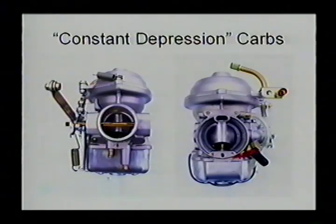We also use dual constant depression carburetors, which maintain a constant mixture as you climb — it's automatic mixture control. It works pretty well on these engines, so you only have typically one throttle lever, no mixture control, and you just start it and stop it with the ignition just like a car.